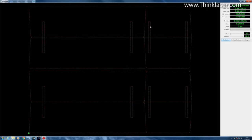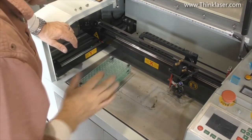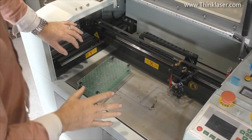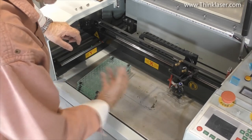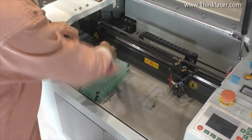It's done a complete replication including the ordering, which is a very useful trick to remember. Normally we'd cut this at something like 25 millimeters a second and 50% power — these are just starting numbers. From previous experience I know we need quite a lot of air underneath the job to extract the fumes. The problem with a honeycomb bed is two things: you'll get marks on the back of your job, and there's not very much airflow through it.